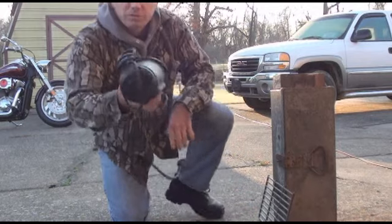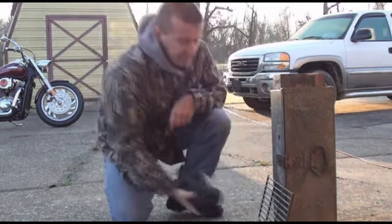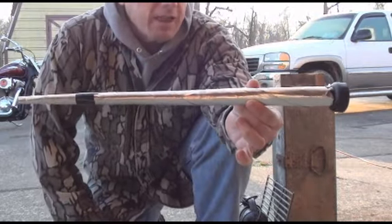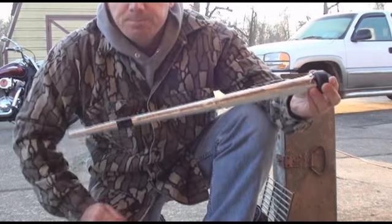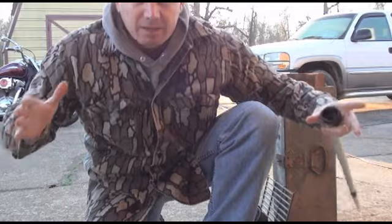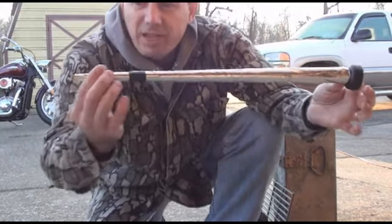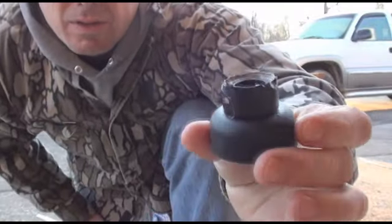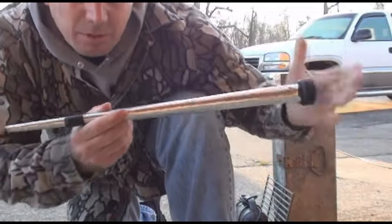That was just extra. My air is going to be from an old Intex air mattress inflator. What I've done to get my air transported from my blower to my firebox is this: all this is is a 99-cent piece of aluminum off the bottom of a turkey pan. You set your turkey in it and cook it. I just picked one up at a grocery store, cut the bottom out of it, and rolled it. It's bigger around on this end and I've just tapered it down to fit into the hole on the box. This right here is just a piece off the blower, and all I've done is put a little Gorilla Tape on there — enough to where I can slide it in so it's sealed and I can get the air from point A to point B, which is the blower to the box.